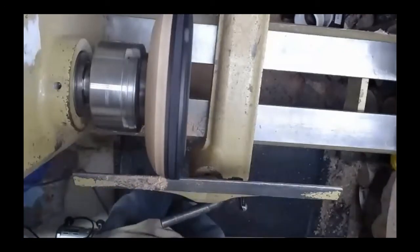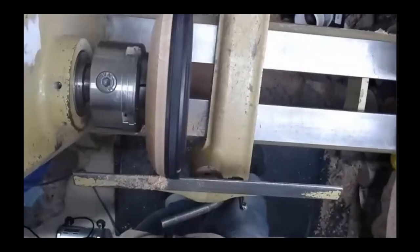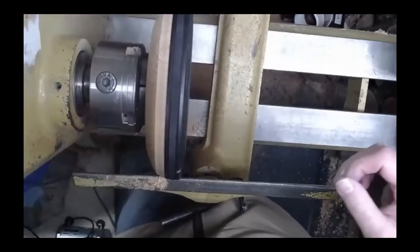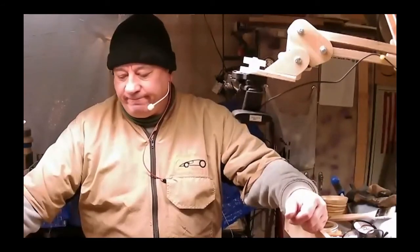Is there a restriction on what kind of finish you can put over that embellishing wax? I usually spray lacquer on it. If you're spraying lacquer, always do light coats so you don't interfere with the paint or the texture. You always want to spray light coats so you don't interfere with whatever texture you've applied. I've had success spraying clear poly also — again light coats. You want at least two or three very light coats on there before you try to increase the depth of your finish.